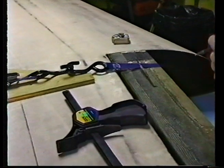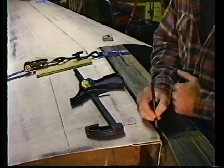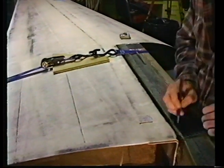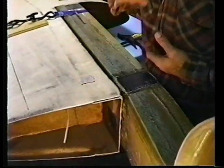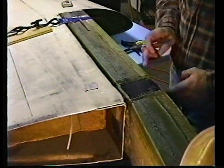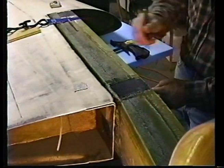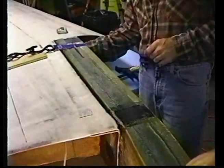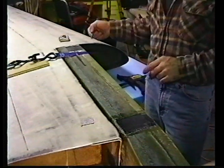We're going to remove all this stuff and show you how he began prior to mating it up to the surfaces. We'll take it off and we're going to transfer these marks down to the appropriate height for the drilling, and then we'll show you how we transfer those marks to the forward face of the inboard portion of the spar so you can maintain perpendicularity to the face as you drill through. We'll show you that process. Drilling this part here is very easy because it's open and accessible right from the end. Doesn't take any transfer to the forward face whatsoever.